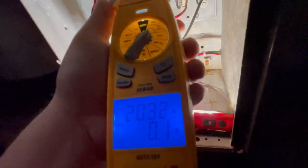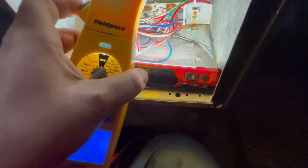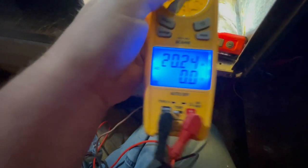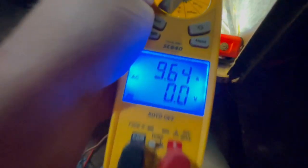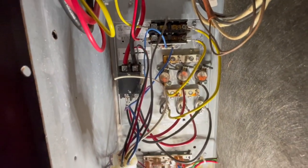I'm thinking this is weird because we sure as hell didn't have any heat when I kicked that thing on last night. I've got all 15kW working. It's that top contactor buzzing. The elements off the bottom contactor are both working, so all 15kW is working. But I'm going to go ahead and change out that top contactor just to be safe.